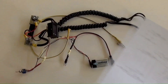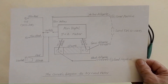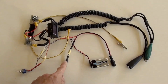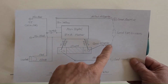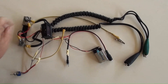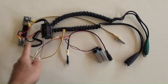The battery's terminal black wire, joined with the meter's black wire, runs along here. Also the DC power socket's black wire is joined with the battery's black and meter's black wire together here. The other end of the heavy duty wire, joined with the thick red wire, is bolted here. The other end of the heavy duty wire with a black alligator, joined with the thick black wire from the meter, is bolted here at the bottom.